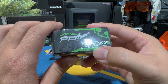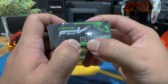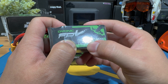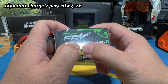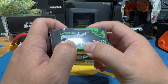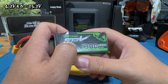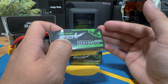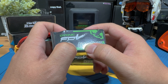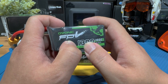Next, let's look at the factory default voltage — you can see 22.2 volts. Note this is not your max charge voltage or minimum discharge voltage; it's just a factory default. For a lipo battery, the maximum charge voltage is generally always 4.2 volts per cell. So for a 6S lipo, your total max charge voltage would be 4.2 times 6, equaling 25.2 volts. When charging, the individual cell max charge voltage you need to set is 4.2.